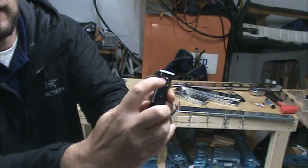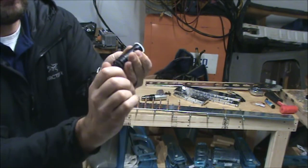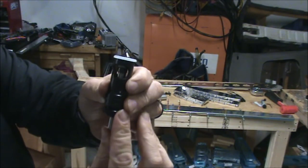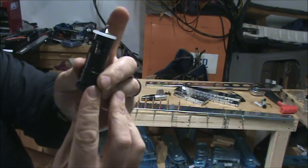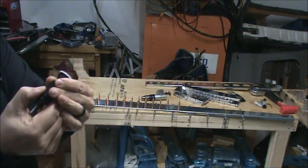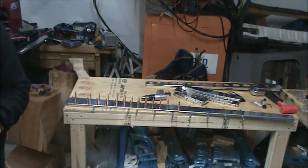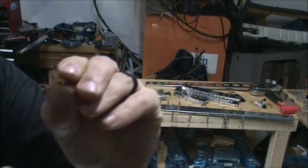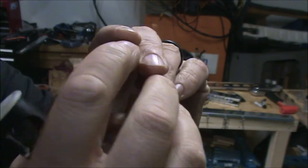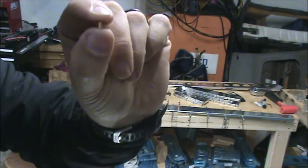The cutter just goes in here and then the two halves screw together. This has a hole in it that you can stick an allen key or a nail through to hold it while you tighten it. Once it's tightened in there, if I push down on it all the way you can see the tool is protruding almost the entire distance, which is entirely too much. You have to figure your countersink depth is only that little bit right there — not very much, just the head of the rivet.